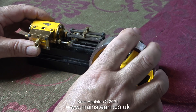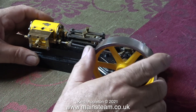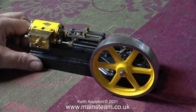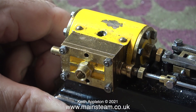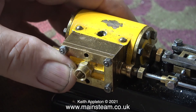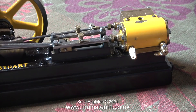On this engine the piston appears to hit the inside of the cylinder at the far end of the stroke. Luckily the cylinder is loose and moves out of the way, although the cylinder is not meant to be loose — it is a common problem with Stuart S50 engines. A close-up shows just how much it's moving; it's only held in place by four screws underneath. This currently looks to be the worst of the three from a mechanical aspect.